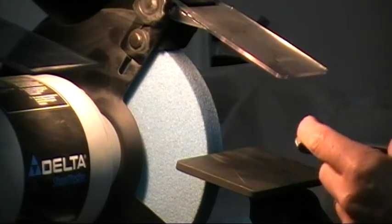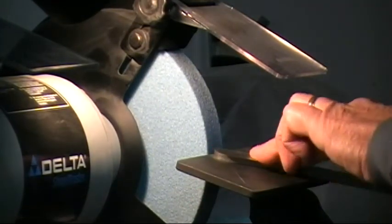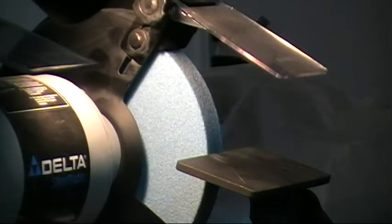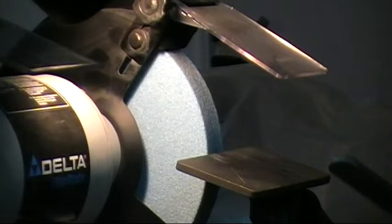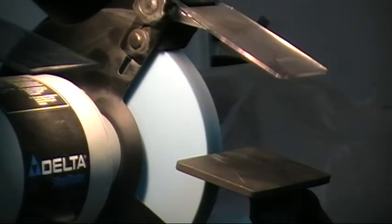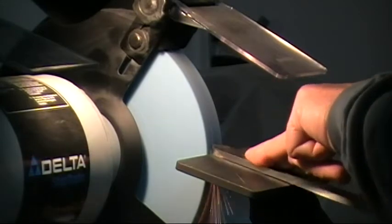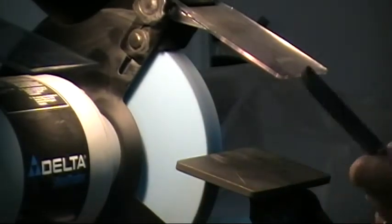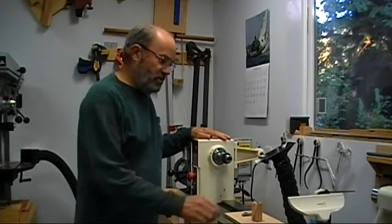As you can see, there's my 70-degree angle — exactly what this is here. So you just turn the power on and it's a matter of rotating it back and forth against the wheel. Basically that's all you need. Once you have the initial shape ground, touching them up in between is nothing to it. Here's how quick it goes. That's it — that scraper is all sharp and ready to go.